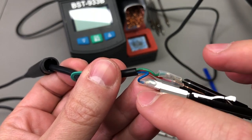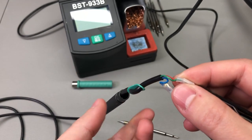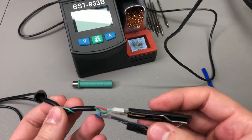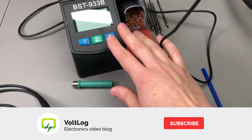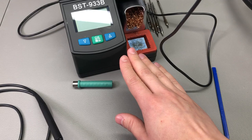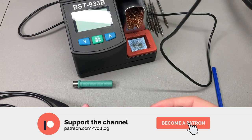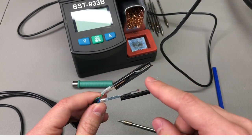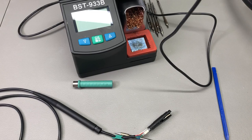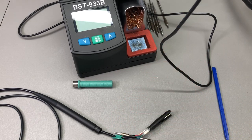There is good attention to detail in the way the wire harness is handled inside the handle - it has some strain relief, the solder points are heat shrunk and isolated, so those are all good things. I also have a genuine JBC station on its way to me, so I'll be able to compare the Best station to the original JBC in a short while. Thank you for joining me in this short video - I hope this was fun to watch. I was personally very curious to see how this clone handle failed inside. Don't forget that hitting the like button is free and helps the channel a lot, but if you'd like to support me via Patreon you can do so with as little as one dollar per month. Thank you, and I'll see you next time.